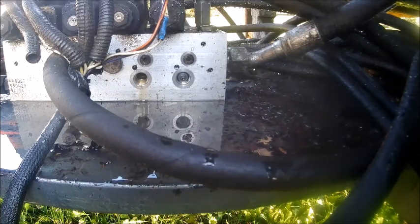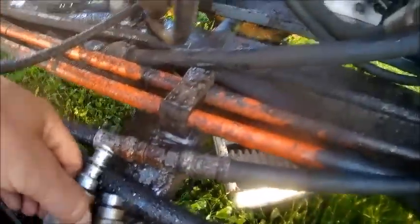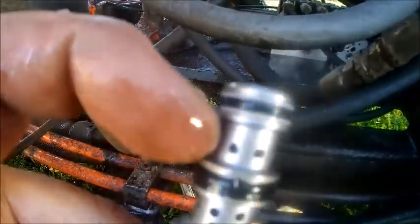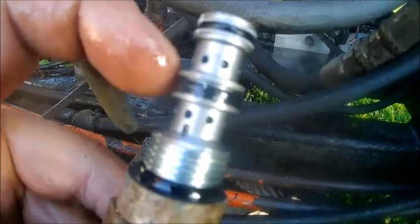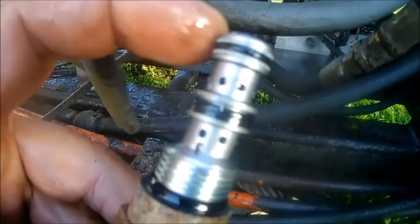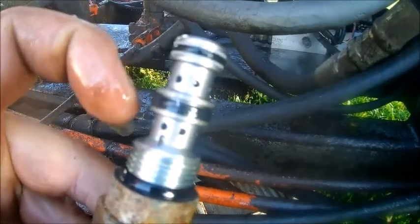We tried last year and gave up. What I'm afraid of is there's maybe some piece caught here and we get too aggressive pulling this out and we mess up where the seals go, separating the passages. Then we're going to leak from passage to passage, making that block possibly junk. So there's my big fear. If we can screw things up, it's usually done here.